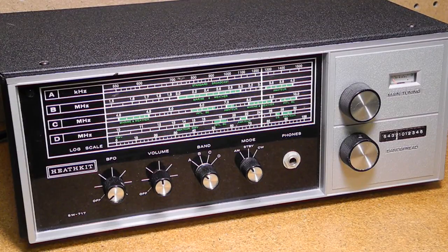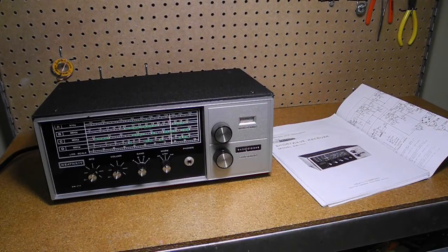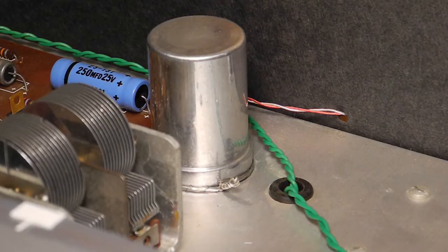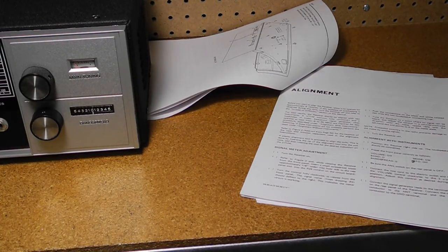I obtained this unit at a garage sale in 2009 at a price I couldn't resist. It was working and quite clean. I replaced the line cord, which was in bad shape. At some point the rear feet had been removed, so I added some plastic pieces to prevent the screws on the bottom from scratching the bench. It did not come with a manual, and I purchased a copy from Data Professionals, who bought the rights to sell the official manuals from Heathkit. An audio hum problem is common, typically caused by a poor connection between the case of the aluminum filter cap and the chassis — mine had this problem, so I added a ground strap and re-soldered some connections. Another common problem is oscillation on the high end of Band D caused by electrolytic capacitor C24 going bad; mine did not suffer from this issue. I did a full alignment using an accurate signal generator following the procedure in the manual.